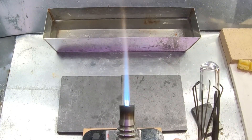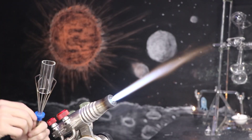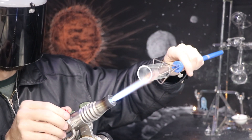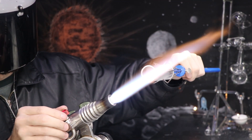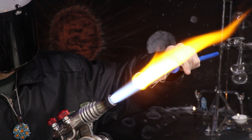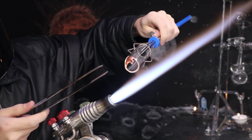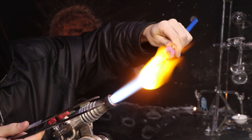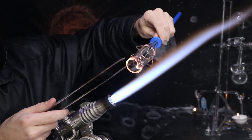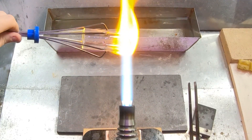I'll use the second stage of this torch as well. The second stage will add more fuel and oxygen around the outside of the flame. This will increase the volume of heat, however not the temperature. The temperature is more dependent on the purity of oxygen, along with what fuel I'm burning. So increasing the purity, or switching to a fuel like hydrogen gas, would give us hotter combustion.